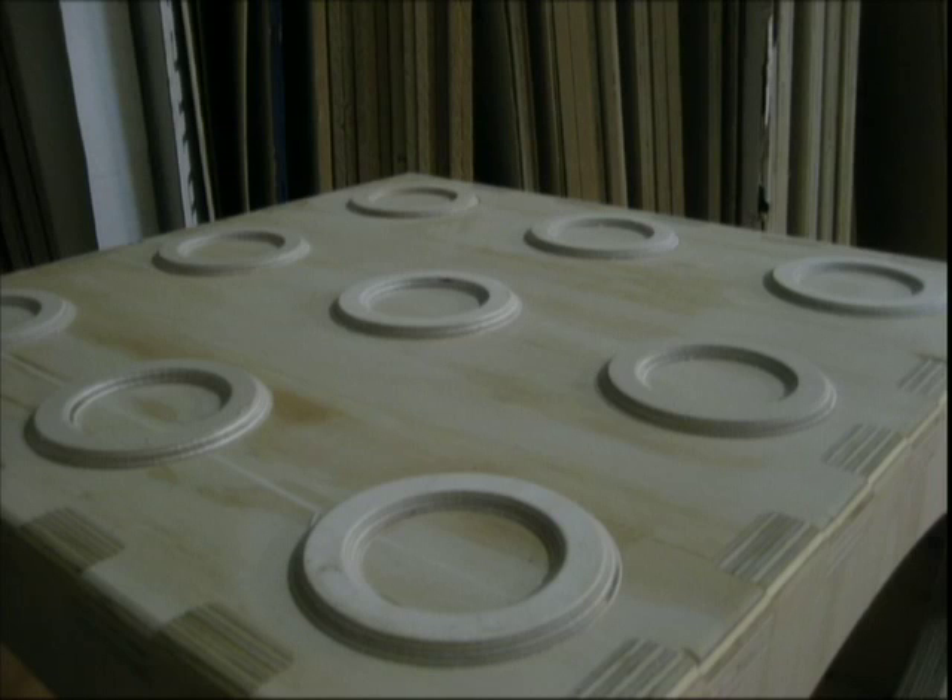Here's the bottom of one of the units — rings fit into the negative on the top with a beveled edge for a positive fit. They're heavy and gravity does the rest. To get those rings so perfectly I use a technique I call 'press fit extrusion': pocket a ring into the material, cut matching rings out of another piece of plywood, put glue in the groove, pound them in with a hammer, and you're done.